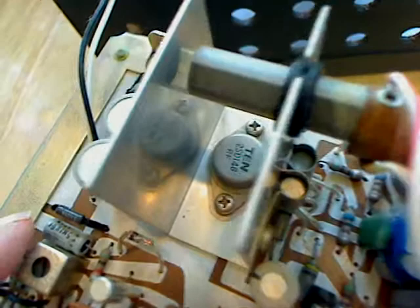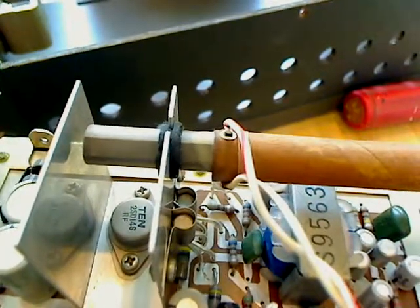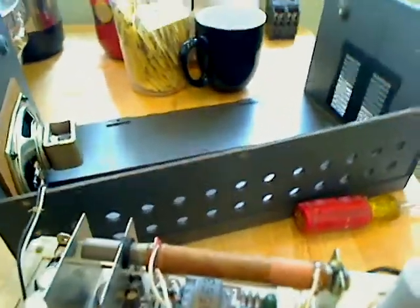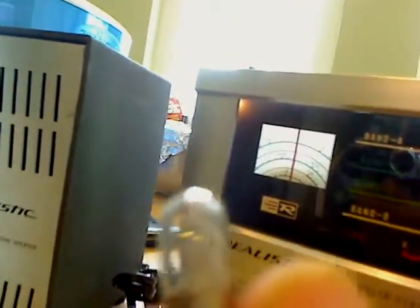Having determined that was not the problem, I went ahead and tested a few other components. It actually turned out that this Zener diode — that you see down here that I'm pointing at — had gone bad. It tested open throughout. I don't know how, perhaps a surge, but it's unusual that it didn't take out the power transistor, which tested fine. I re-seated that with some thermal grease, being careful to get it on the mica so we wouldn't have any shorting. Anyway, I replaced that Zener, and when I went ahead and put it back on the Variac, well, what do you know — it started up and I brought it up to power, and it came up just fine. There is one light out on the unit; it's a simple bayonet style bulb — although this looks lit up, that's just backlighting. A simple bayonet bulb will have to be replaced, but otherwise it's a fun project.